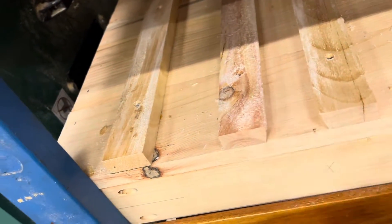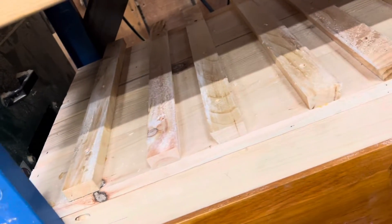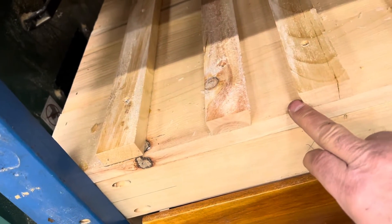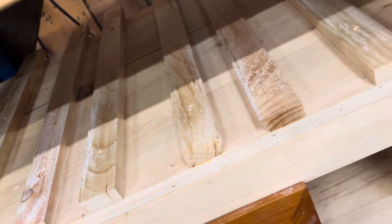If you notice this white residue — it's ivory soap. Soap these up, that's what we did in the old days. And then this over here keeps the drawer flat as it goes through. So that's going to be running up on this portion of the slide and this portion of the slide here. I've got a couple of slides here dovetailed in so it won't fall out, and it kind of fights against itself so it stays in place.